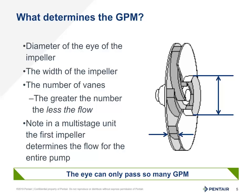How can you overheat an impeller? First, remember that in the smaller horsepower pumps, the impeller is often plastic, for example, in most of our jet pumps. Knowing this, if the pump is running in a deadhead condition, the water can in fact heat up enough to soften this plastic and cause the ports to collapse, thus pinching off the production and flow. Damage and wear to the impeller will often affect the pump's ability to build pressure, whereas deadhead or heat will often cause more of a flow issue as well as a pressure issue.